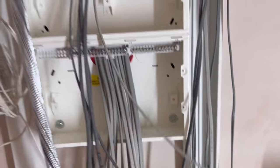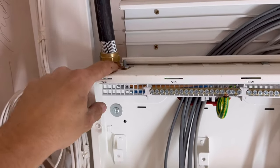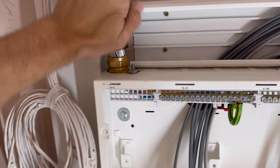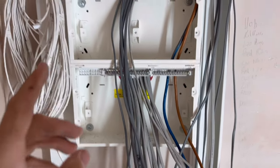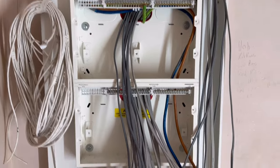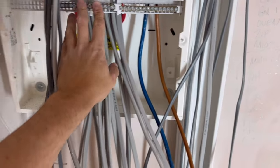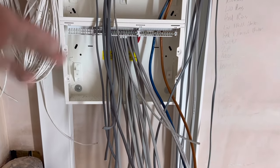Armored is made off - roof nut and bolt earth, all done, dust shroud on. Eventually got the cables down there ready to go into the main switch - a bit of a pain getting them in but they're in. 25mm earth into the earth bar, ready to go. Now we're just going to start stripping the cables back one by one, get all the earths into the earth bar first, then get the DIN rail on, breakers in, and second fix.